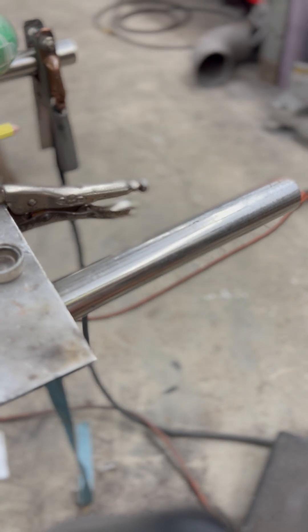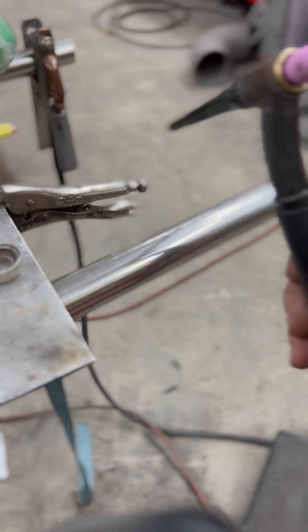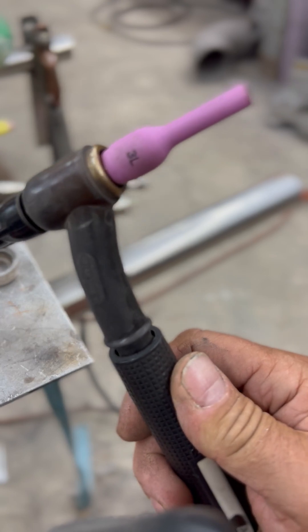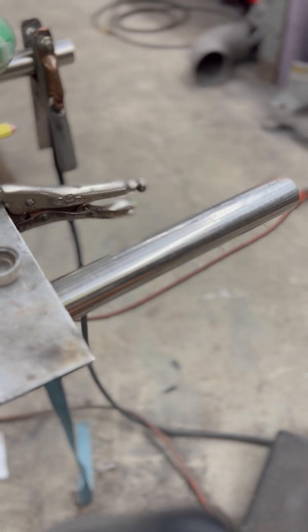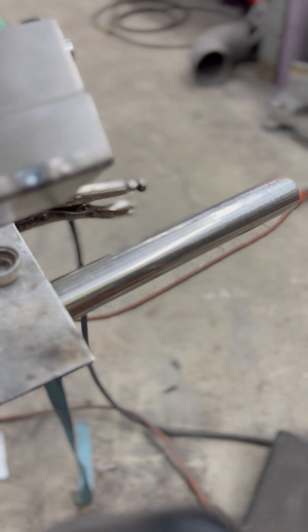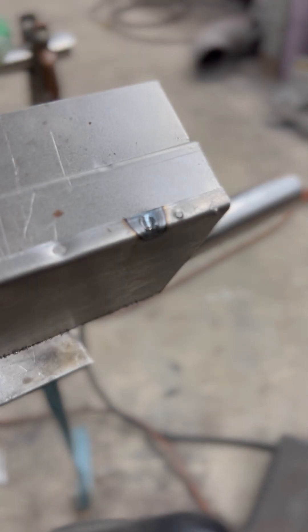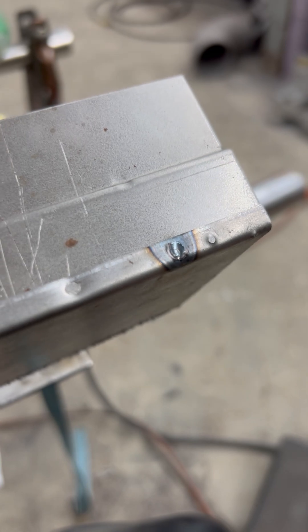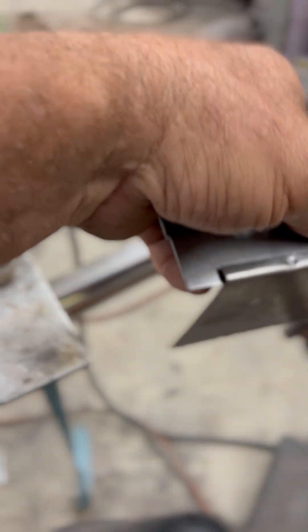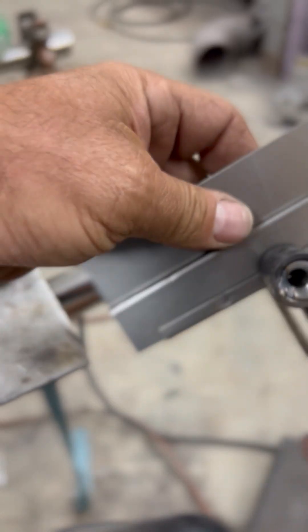The sleeve here we made for a 3L TIG cup. That gives a nice tight circle around it to give you a little dimple just like that. We found that the number four is hard to keep from burning the edge, so next size down and we're gonna do another test sample here.